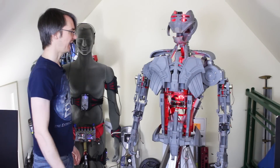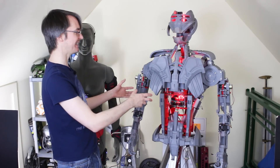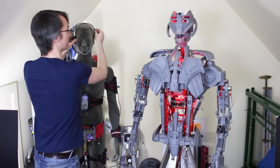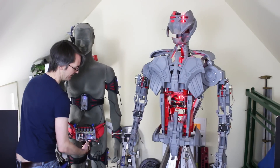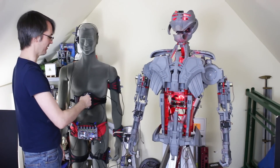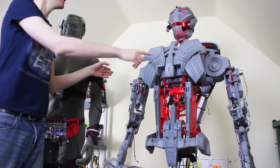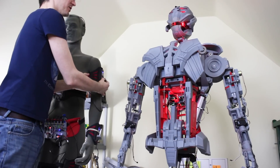After some messing around I've now mapped the IMU on this arm to the upper shoulder, and I built this robot to match the Euler angles exactly like my test arm. If I move the sensor in the z-axis we should see Ultron's left arm moving, and if I pick up the whole mannequin and turn it the arm should stay relatively still. It's only when the sensors move against the body sensor that it does anything — wiggling the body sensor moves both the head and the arm. I've set up the other arm to mirror in the opposite direction, so when one arm comes forward the other goes back.